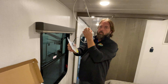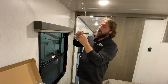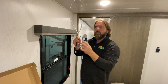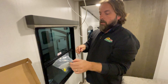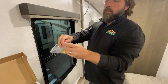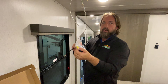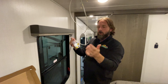That's why they give you the switch — so you can break this wire to turn it on or off. Cut the wire, strip it down, connect both white wires into black together with a wire nut, and I'd suggest taping the wire nut afterward so when you push it up into the hole it doesn't come disconnected. The other side gets a spade connector on the positive wire going to one side of the switch, and another spade connector on the other side. You still need to keep the other wire hooked up so power flows through — that's why they give you the second wire nut.